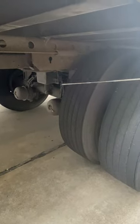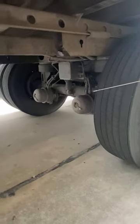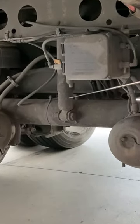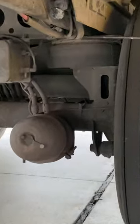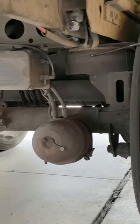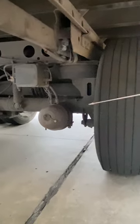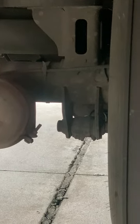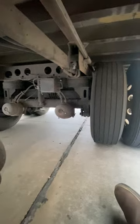We go over the suspension and brakes again. Suspension on the trailer has four components. We have one shock absorber in the middle, properly mounted and secured, not cracked, bent, or broken, and no leaks. Then we have two airbags — one on each side — properly mounted and secured, no abrasions, bulges, or cuts, and no leaks. Behind those, between the brake chamber and the tire, you have a torque arm and a torque arm mount, both properly mounted and secured, not cracked, bent, or broken. The four components are: shock absorber, airbag, torque arm, and torque arm mount.